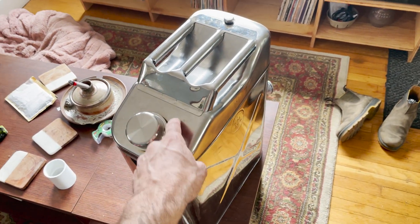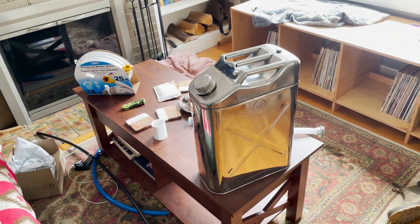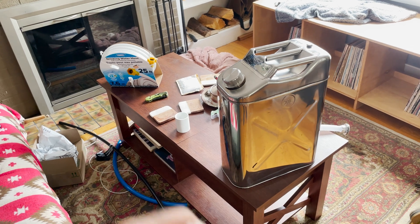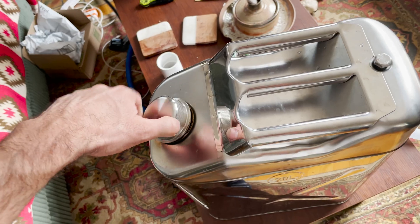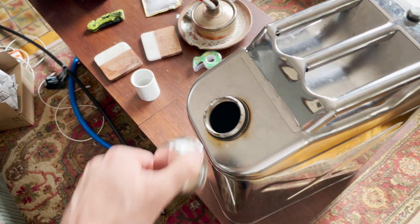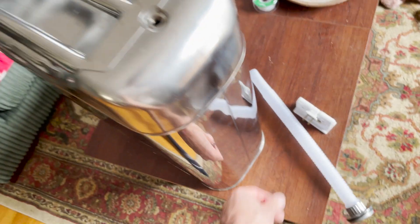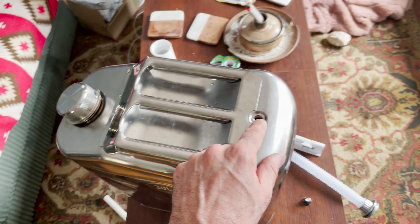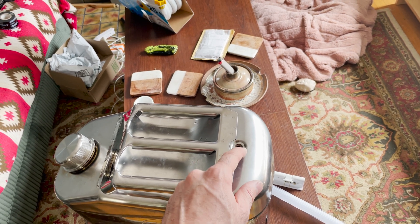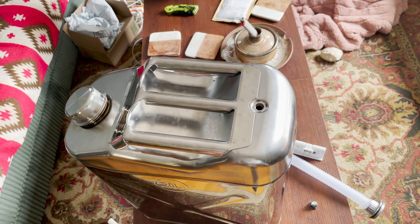It's not really rated for pressure, but my thought was that if I can use an air compressor to add just a little bit of pressure inside, it should allow water to come out the end if I have an airtight hose going in. There are two holes on this tank: a main output and a little vent hole. I was thinking it'd be great to get a bike pump Schrader valve attached to that little hole.